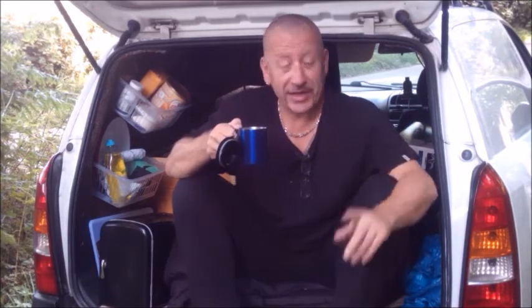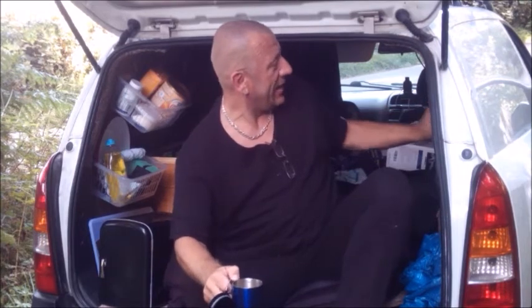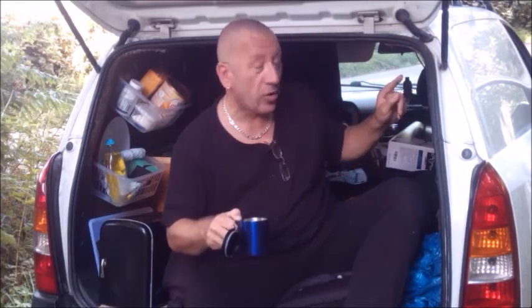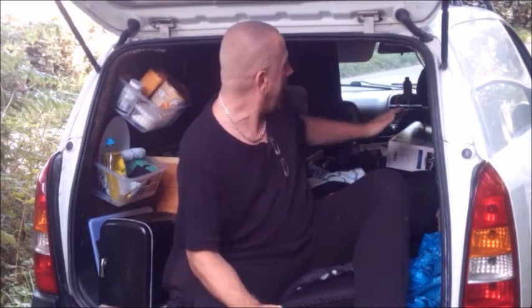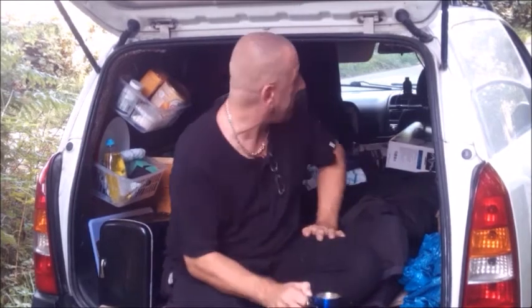So what we better do is make a bracket holder panel for this at the back here. I've got some wood at home, so we're going to cut it to the same shape and size as the TV itself. Screw directly into that wood to hold the bracket and telly on, and then screw all the way around the board. That is going to give it a lot more stability, and I want to safeguard that TV from ever coming off. I could fix it down the front, like I said, and the wire would reach, and I could just have my pillow down this end. I'm still undecided which way we're going to do that.